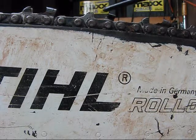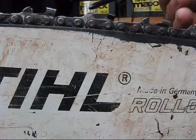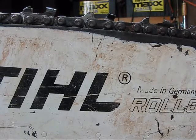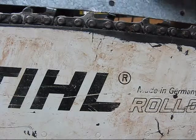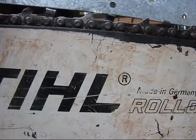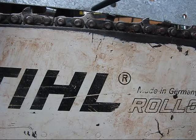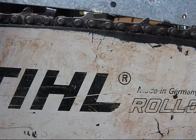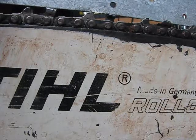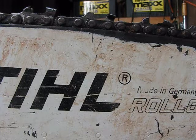This little depth guide here is what confuses people — these guides control the depth of cut of the blade. A lot of people forget to remove material here, and this little piece starts to run in the shadow of the lump and doesn't cut anything anymore. You need a straight edge you can lay across a couple of teeth to check for clearance — about two sheets of notebook paper worth. If the guide is higher than the teeth, it won't cut at all.